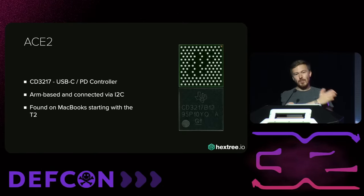Unfortunately, I couldn't get it to boot a modified firmware. But at least I didn't fully brick it. In the end, I tried my software vulnerability, I tried physical SWD access, I tried modifying and switching the flash contents — even between different ACE chips, but they all seem to have a unique signature. You can't take the left ACE and put it on the right ACE. I tried fuzzing and actually found a timing side channel that lets me enumerate the commands the ACE3 supports — but that doesn't really give me anything.